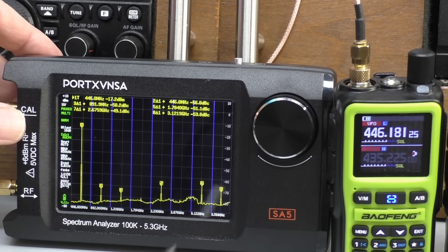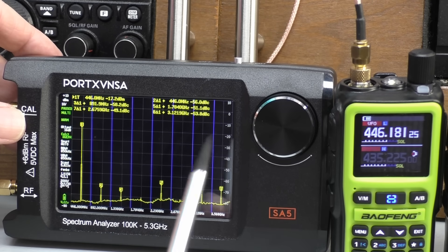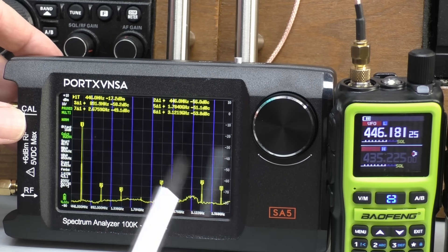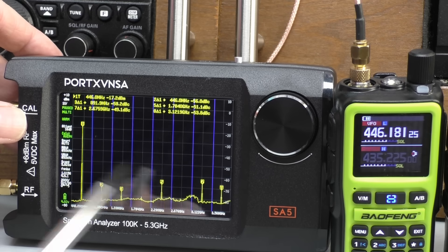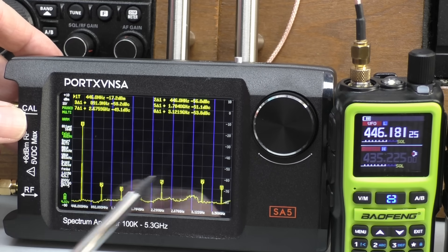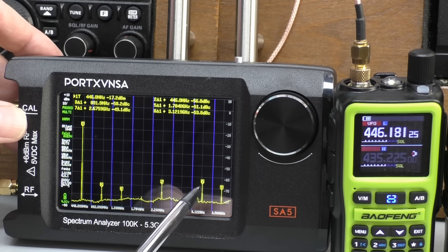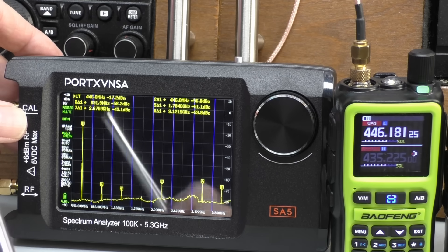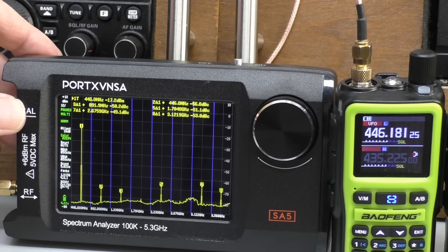Here's the harmonics test on 446 MHz PMR - the radio has done okay, it's pretty clean. It's designed to transmit on 462 MHz, the American public band, and here's the fundamental signal. In other videos we need four clear squares to pass a test, and we're well above that - even going to the seventh harmonic, that's over five and a half squares. So it's a pretty clean radio compared to some we've tested recently, and I would say it's safe to use on 446 MHz.